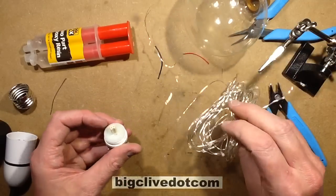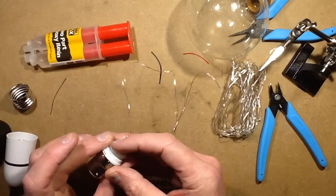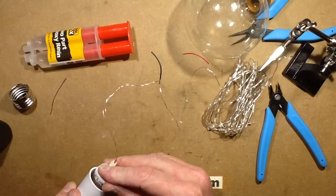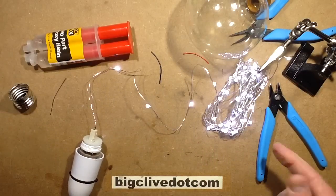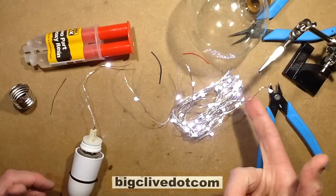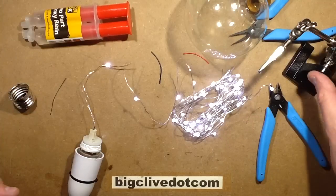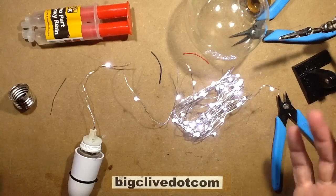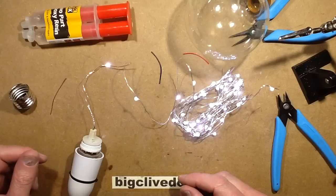So the lights themselves, well, let's actually try this out. Let's plug it into the bayonet cap holder this time and plug it in. And I would treat this as being potentially live at mains voltage. It's theoretically isolated, but it's a very small transformer, and because the things are normally isolated, I would say don't play about with them while they're plugged into a module like this.